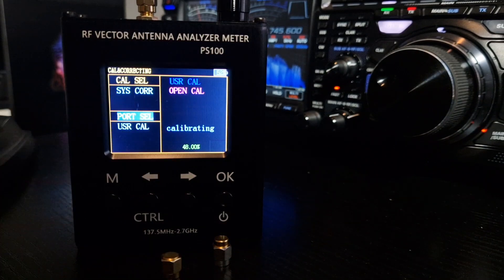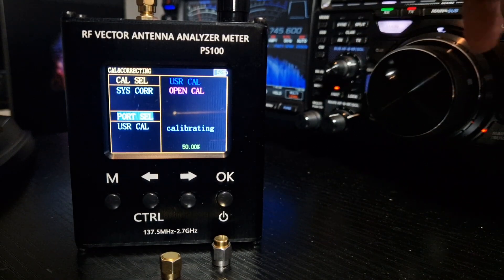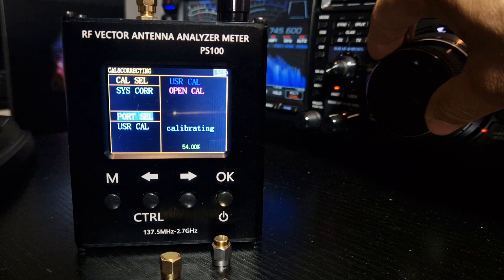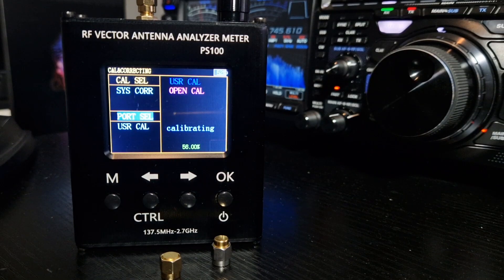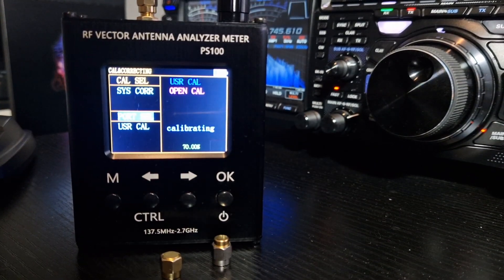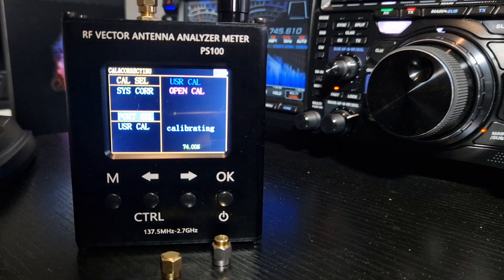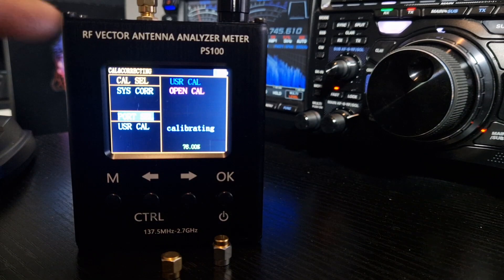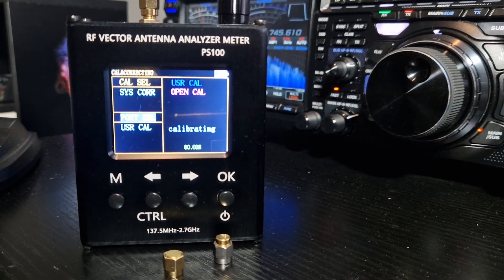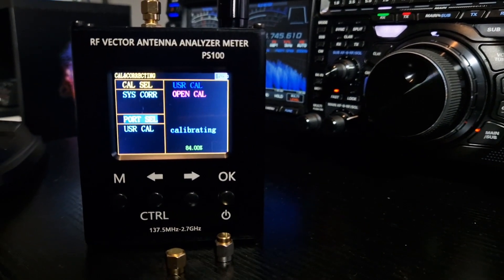It's still counting — 46% — so there is a wait. What I do like about some of this equipment that comes from AliExpress is that generally it's in a metal case. It's nice and solid, it feels like it will last. And it's a very quick way, once you've calibrated it, to test your SWR if you're worried about your 2-metre or 70-centimetre antenna.